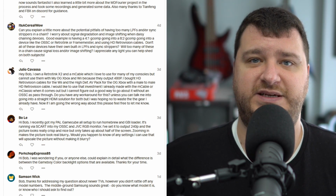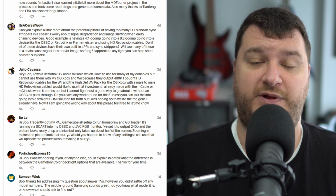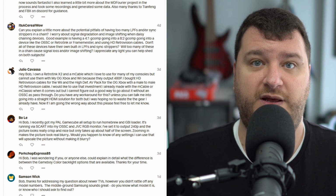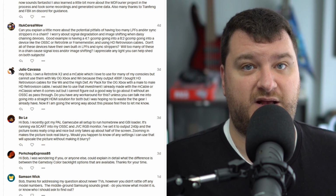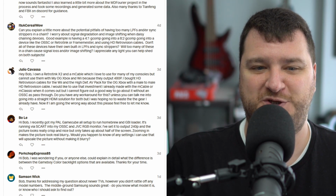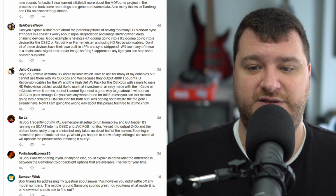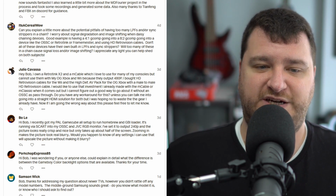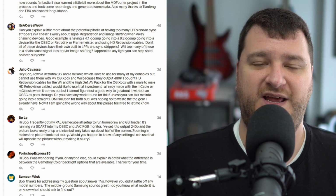The only thing I could possibly see is individual situations. So if you're using an Extron Crosspoint, for example, as your switch, at the moment, I think the only consoles you'd have to worry about are PlayStation 2 and PlayStation 1. And in that case, you could use a sync stripper, or you could just do a C-Sync mod to the console, depending on your needs. So it's one of those things where every scenario in which you might use a sync stripper, you could probably have a different or potentially better solution. So it's really just best practice and promoting good safety. But there's actually nothing wrong with having a bunch of properly built low pass filters and sync strippers in a chain. It's not going to hurt anything.